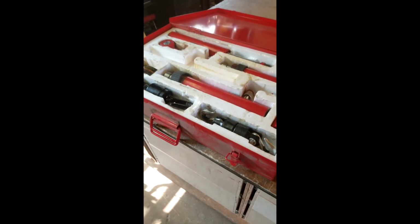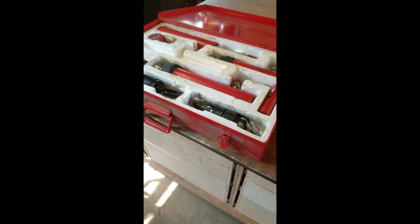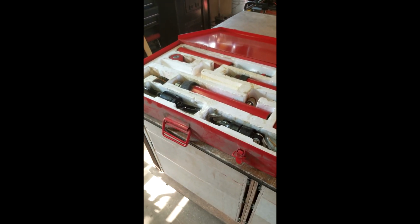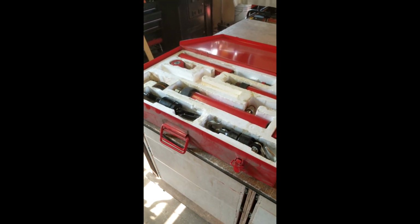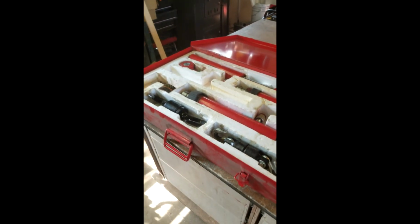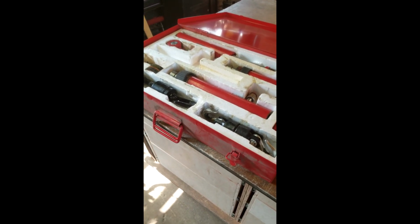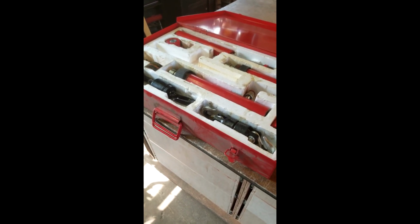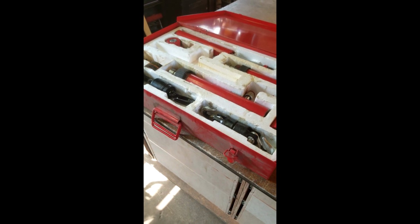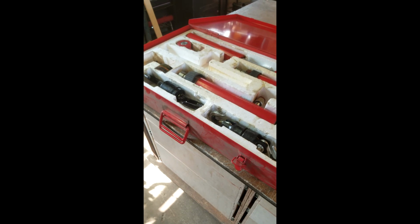If you have to move something or bend some metal or tweak something, you wouldn't believe how fast this will pull a post out of the ground with 4 or 5 sacks of cement on it. You just use the push cylinder and wrap a chain around the pipe a few times and get a good pinch on it, and this will yank them right out of the ground.